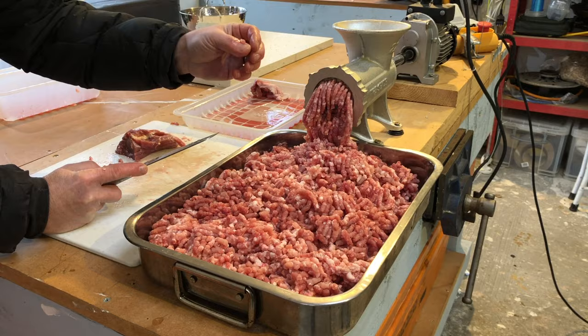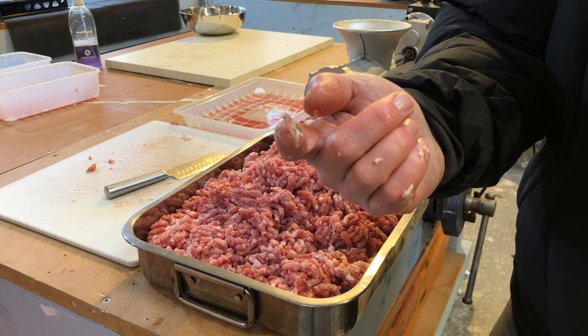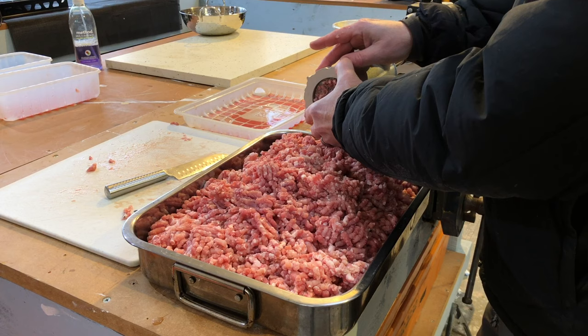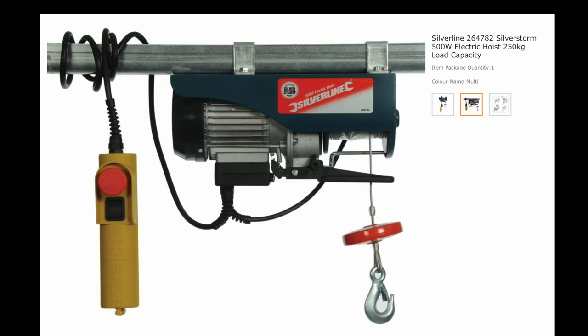The electric hoist motor makes quite a few funny noises but I think that's just inherent in the thing. At first it sounded a bit wrong but it just seems to work. I'll show you the residue — the metal residue or oxides from the blade. That's about the level you would expect from this amount of meat. Sometimes it could be double depending on what's going on, but it shows itself — you can't mistake it amongst the meat, it's obvious. You just pick it out and the job's done. To minimise it, just make sure you don't tighten the lock nut up too much — if you turn it up too tight it's going to push the blade into the disc and cause friction. Next video will be the special salami. Bye.